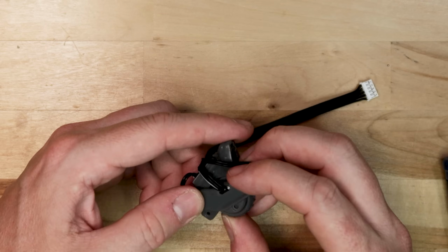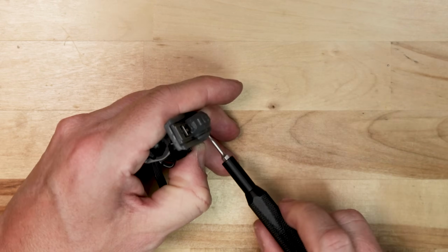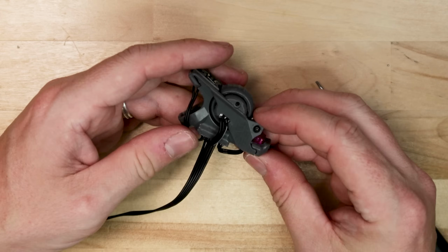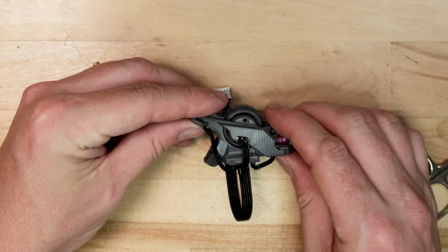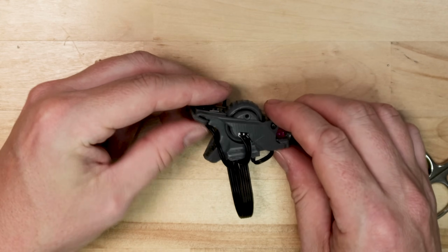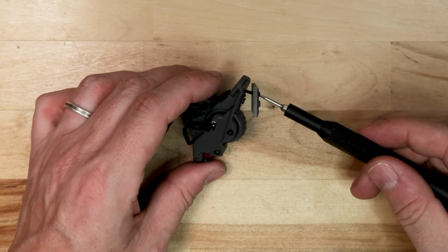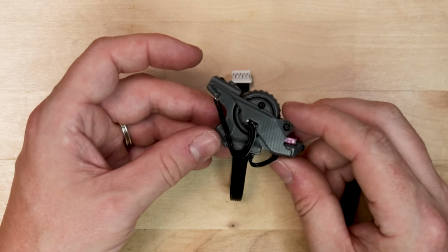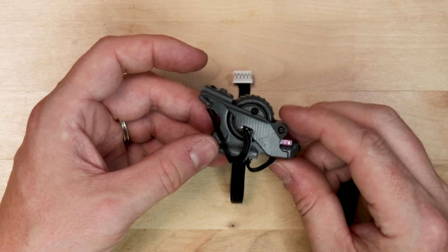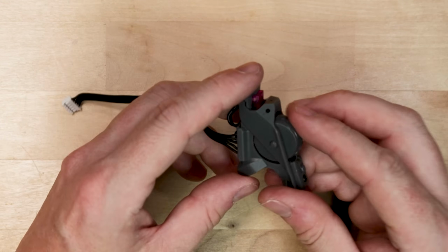Final step is to hook that flex frame down over the cradle and secure it in place with the DPI cap. Once this is all done, the wheel should scroll smoothly and you should get a nice clicking motion hitting that mouse switch when you press down. I'd highly recommend plugging this into the Statial B at this point and just testing it to make sure you're getting a good scroll wheel, mouse button, and DPI switch. It's a lot easier to fix any wiring problems at this point than it is after the full assembly.